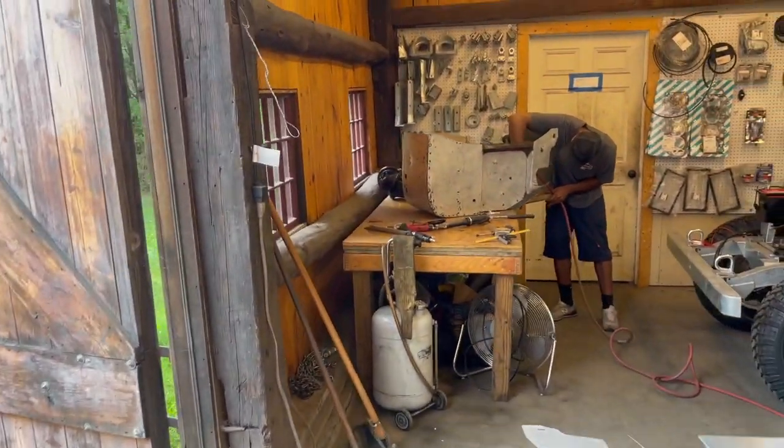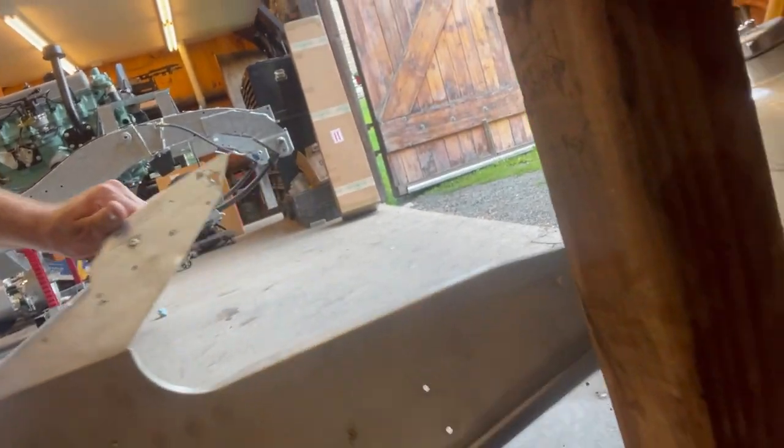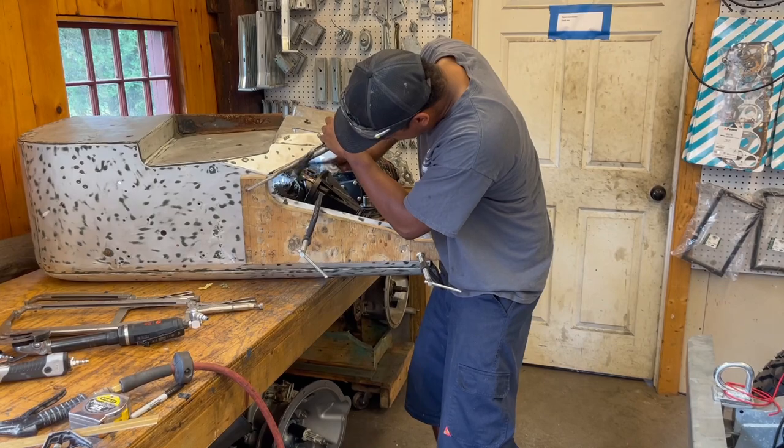So like with all of our restored trucks, this truck is also getting the power brake conversion because, honestly, I wouldn't really consider it safe with a single master cylinder. So here is our jig setup. We're modifying the fender just like it was done in 1968 for power brakes. You can see here is an original fender and that's the cutout for the power brakes that Land Rover did from the factory. And here's our jig that we have to do the exact same cutout, same profile, everything. You would be hard pressed to say that this was not a factory modification on this particular fender. So Alan's just grabbing some clamps and he's going to go ahead and modify that lip so it'll bolt right on when we're ready to get the fender onto the bulkhead.